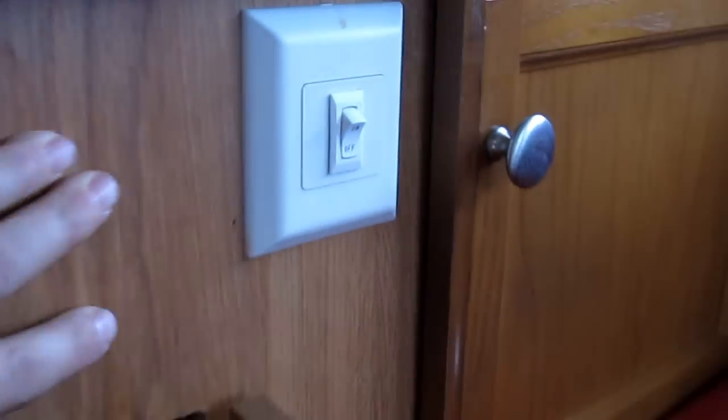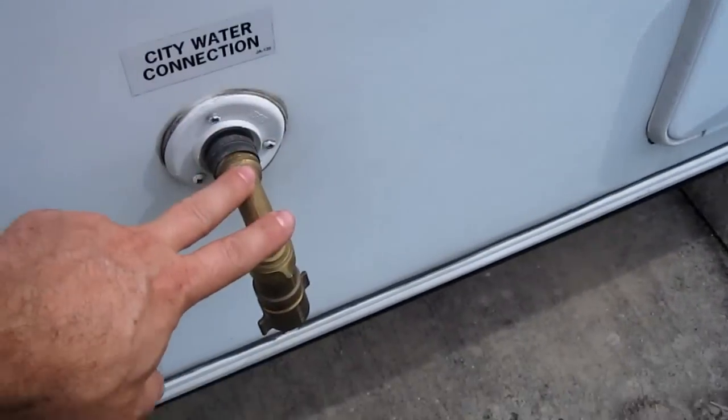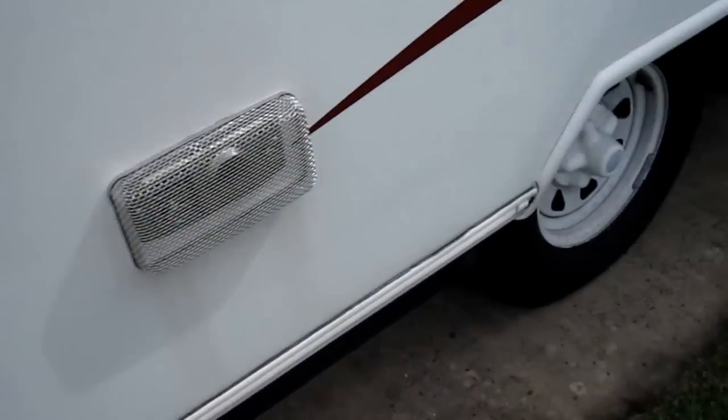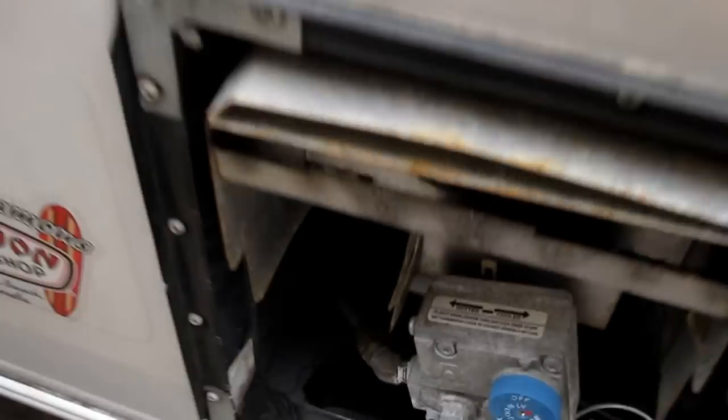and then you take the tube and put it inside your vinegar container, and then you just turn on the pump switch, and you just pump all 3 gallons of vinegar, and it's going to fill the water tank. After that, you shut off the valve again on the tube, and you go outside and turn on the water supply. So you connect your hose, and you fill the tank, because it's a 50-50 mix of vinegar and water.